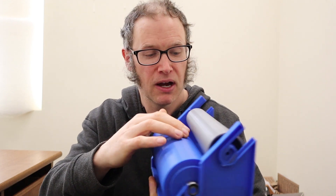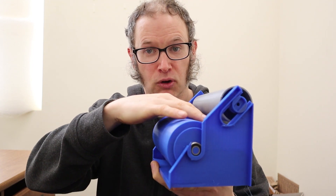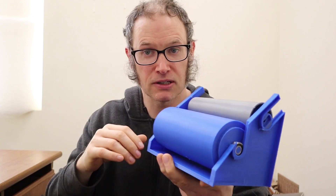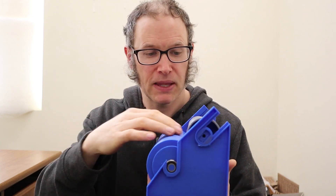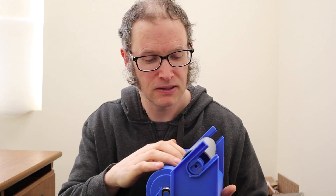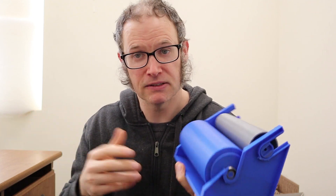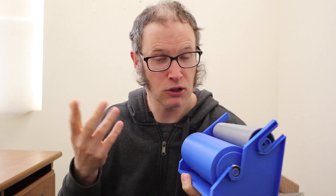As the cone fills up, I have these slide rails on the side and the cone will just push itself back as it gets fuller and fuller with yarn. When it's empty it'll just be pressed up against the drum. I've done some rough calculations — the cones should hold at least eight ounces of fiber, probably more. I'll be able to make different attachments that can hold bobbins or different things, so I'm expecting it to be extendable just like my spinning wheels are. I'll probably release a bunch of files like the cones so people can 3D print their own additional cones if needed.